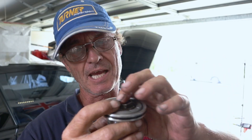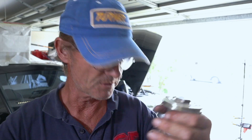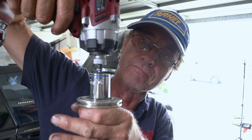The best way I've found to remove these is with a razor blade. The outside one's not too bad but the other one sits down inside a little bit, so just cut it gently with a razor blade and then you can get your pick underneath. Take that one off, and then underneath there's another one — same sort of process. Without the O-rings in there you can see how loose it is, so that's the gap the O-rings are taking up. Inside there are needle bearings and a couple of washers that start to wear down — that's what causes the rattle people complain about. Get them in a soft jaw vice so you don't damage the piston when removing the cap, then use an electric impact gun with a 24mm socket to open it up.